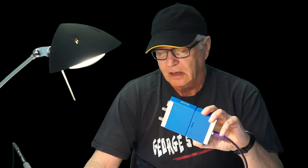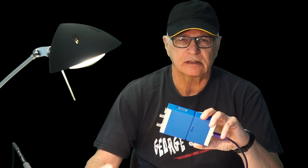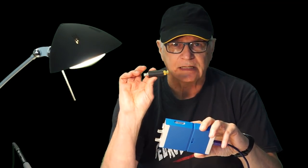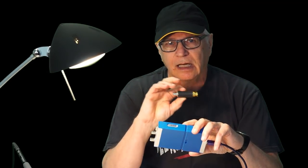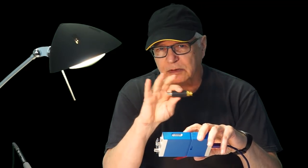The tests we just performed successfully were all within the plus or minus 5 volt range of the OSC-482, as would any test done on 5 volt reference automotive sensors. Should you need to probe at higher voltages — at battery voltage, for instance — this oscilloscope has a 1 mega ohm impedance, which is standard. It will accept all attenuators, including the 4x attenuator we build on this channel, bringing the input voltage to plus or minus 20 volts. That's a real sweet spot for battery-level type testing.